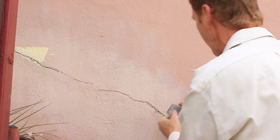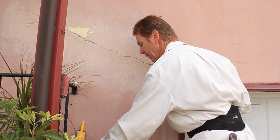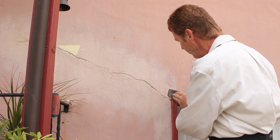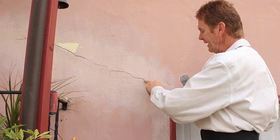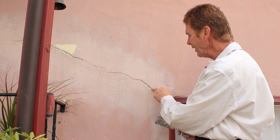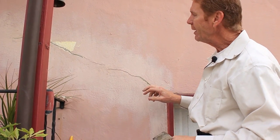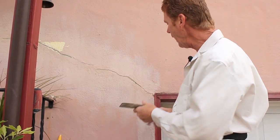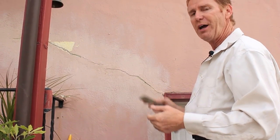I've got a great product I've been using for over 20 years — it's a polyurethane caulking. I'm not going to show the full cleaning on video; I'll go ahead and scrape it clean off camera. When it's done I'll apply this polyurethane, using a trowel first to get it deep into the crack. You could grind it, but that makes a lot of dust and you can't apply most caulkings on a wet wall. So I'll gouge it, wire brush it, then install this once it's all clean.